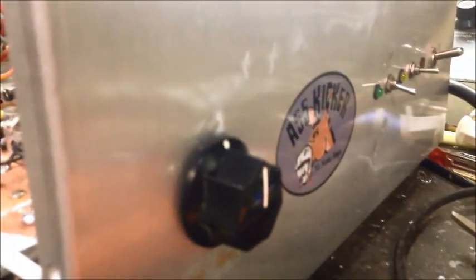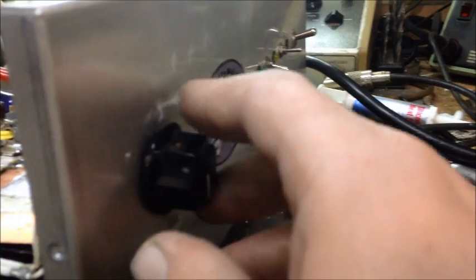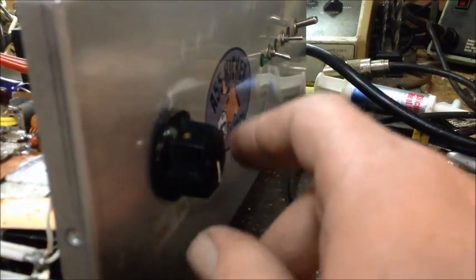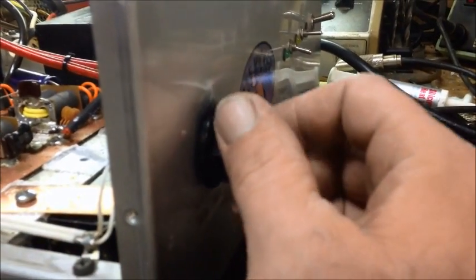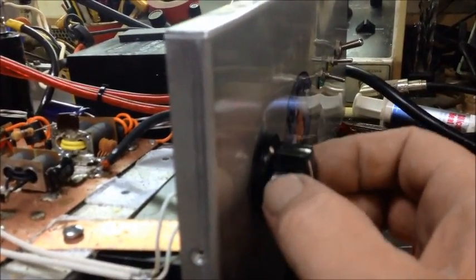On most of these amps, and it's not only me as a manufacturer but any of the manufacturers that create boxes of this nature, the reason they can quote that you can put up to 10 watts into them is because of this variable. Wide open, you're basically putting 0, 1, maybe 2 watts into it. If your radio doesn't have an adjustable dead key, then you need to power this back in order for the amplifier to take more drive, or more dead key, from the radio. You use this variable to set your dead key.